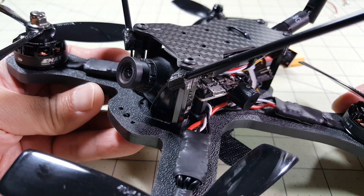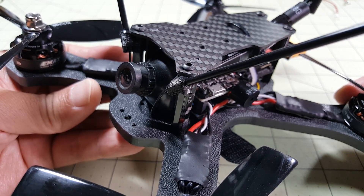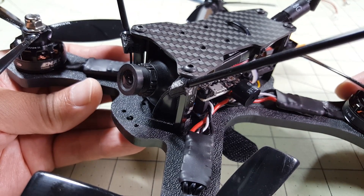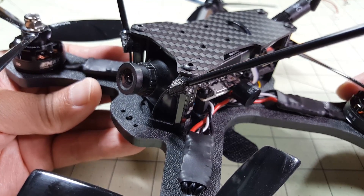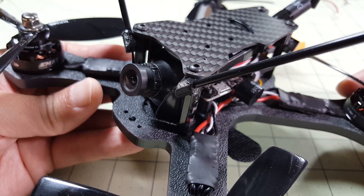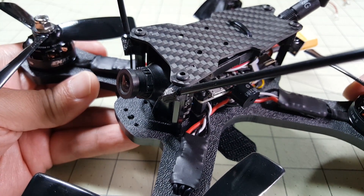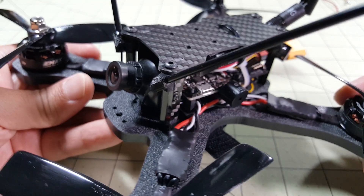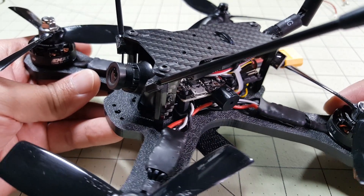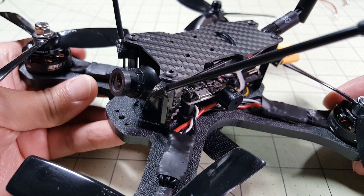Anyway guys, that's my quick build review of the HMB-X4. I haven't really flown this yet — I did do a quick test hover for a couple of minutes to make sure everything's working. I have Betaflight 2.8.1 flashed on here and it's very smooth. It does require some minor adjustments to the PIDs, but I will get this tuned and get some flight video in a future video, and I'll publish my PIDs once I get it dialed in. Let me know if you guys have any questions about this build. If you liked this video, please give me a thumbs up and I'll talk to you guys in the next video.